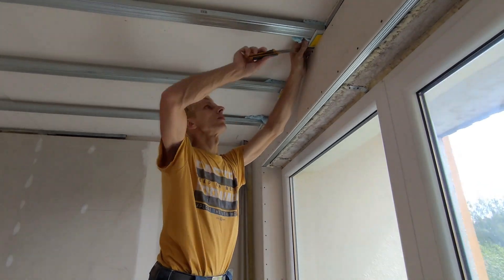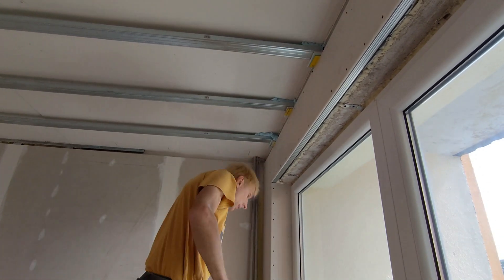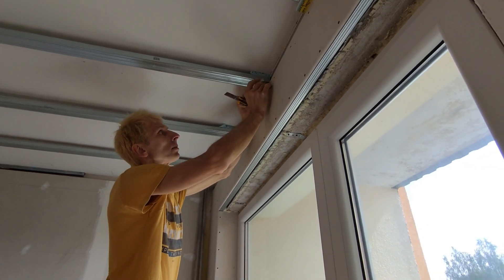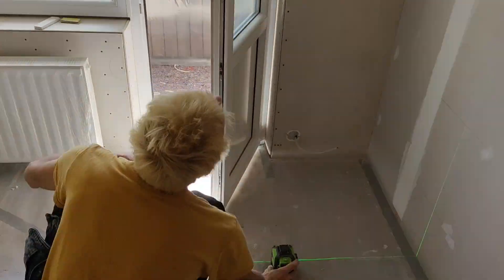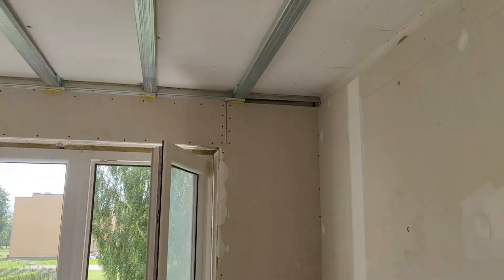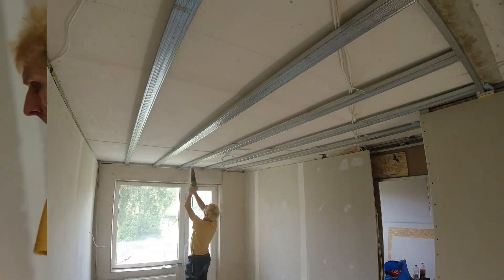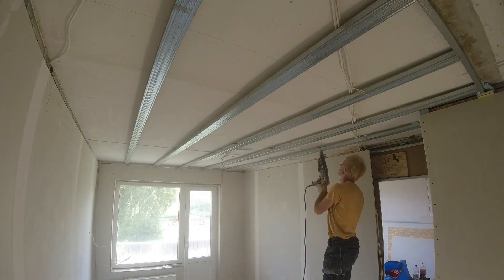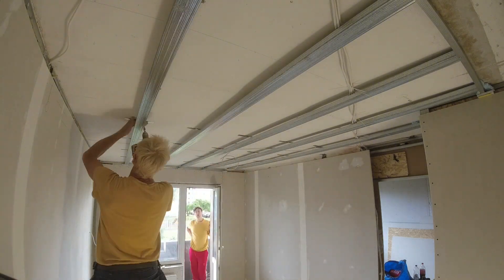The unnecessary foam can be easily cut off. And as you can see, taking out the pieces of plasterboard, the profile remains motionless in place. The next step is to screw the profile fasteners. I use a laser beam to screw them in a straight line more easily. With a good drill, the work goes quickly. And soon you will see the new invention, with the help of which you can easily level the entire row of profiles.